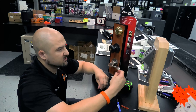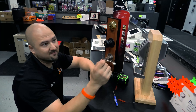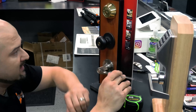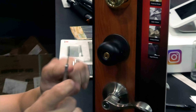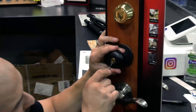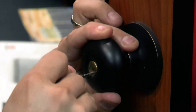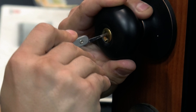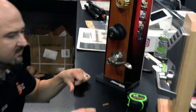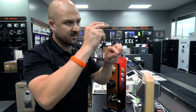Sometimes I get in situations where you can't get the traditional extraction tools in there. So I keep spare broken picks — these are money. I file them down, put them on the grinder, make them thinner so you can grab with them. Broken picks have saved my life many, many times. I'm going to see if I can get this above the pins, down into a divot, and pull it back. This is my last resort if I can't get it with traditional tools — all I'm trying to do is hook the piece of metal and get it out. There you go — that's how you do it.